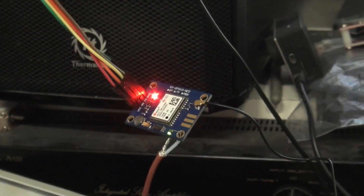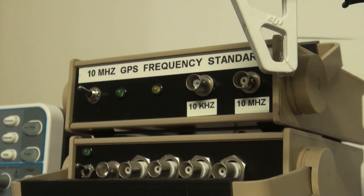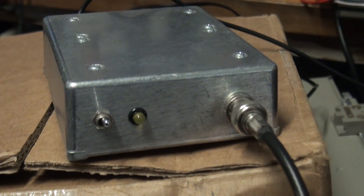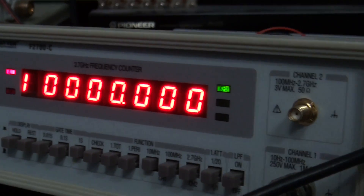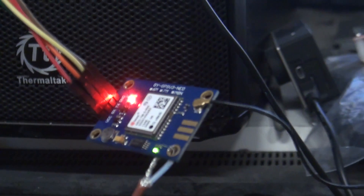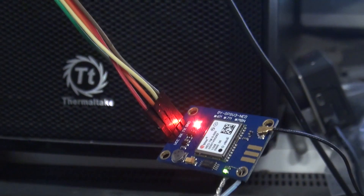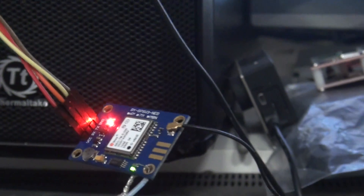I've got a proper disciplined oscillator up there, and another one down here as well, which is the one that's actually generating the 10 MHz signal that the counter's currently reading. But for the money — for $15 — you're not going to be able to beat this thing. If you just want to use it in stuff like frequency counters, it's very accurate and it works fine. There's no reason at all why you can't use that in a frequency counter.